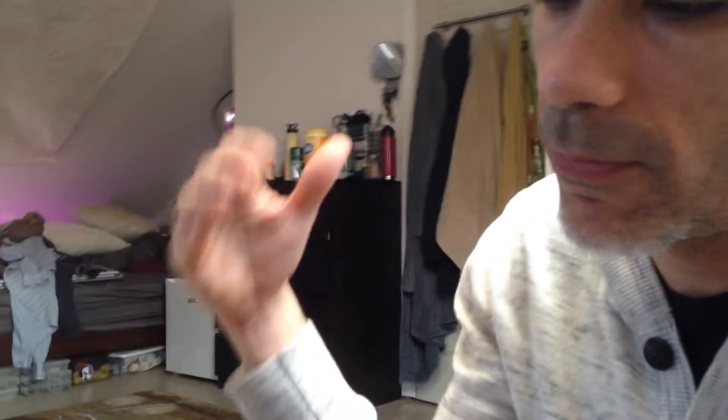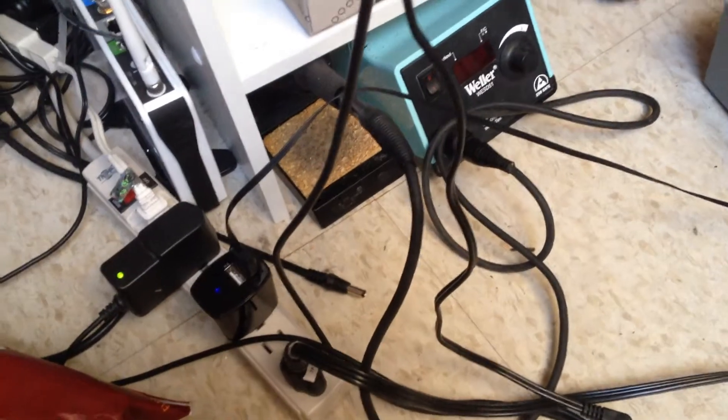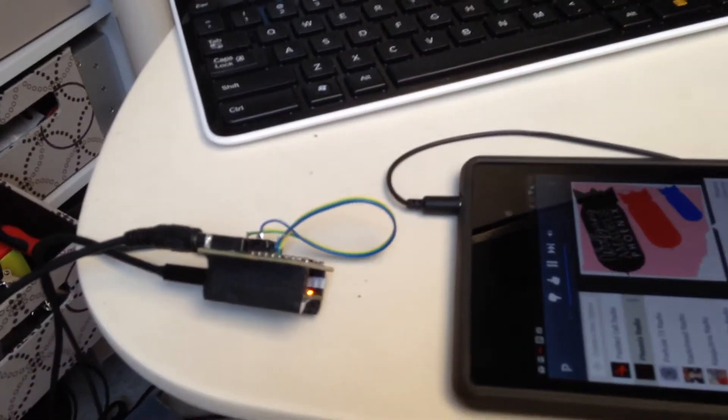Another thing we can do is turn up the input level — for that I have to modify the library. If I turn up the input level, then that noise is reduced, although the reason seems to be that I'm taking the self-noise of the Nexus 7 and bringing it into the picture, exciting the LSBs of the analog-to-digital converter — although that part is conjecture. I don't know if the ADC resolution is poor or if it's some internal stage of the codec. Also, the frequency of that hash wasn't a product of the computer I was using to power it, because I'm using that power source now and it produces the same result.